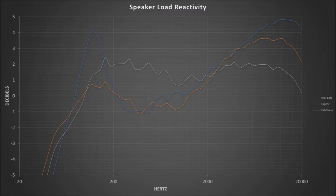That curve looks pretty familiar, doesn't it? It's the same pattern as the speaker impedance curve that I showed earlier, and it's right around that perfect resonant frequency of 100 hertz for this cabinet. Of course, again, depending on what speaker you're using and even what enclosure you're using, that can affect the resonant frequency here, but it does the same sort of scoop out at around 300 hertz and then continues to climb,